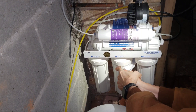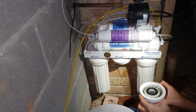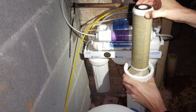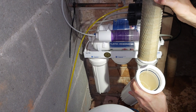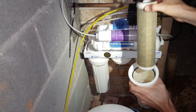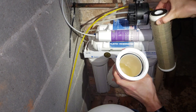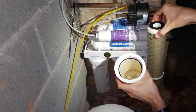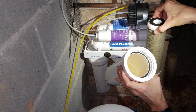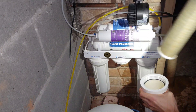The first carbon filter wasn't stuck on too hard. See what it looks like in there — yep, definitely yellow. The water in here is yellow, and our actual water quality is way better than this. I would say I've waited probably too long to change the pre-filters, because I wouldn't want the water in the pre-filters to be yellow like that.